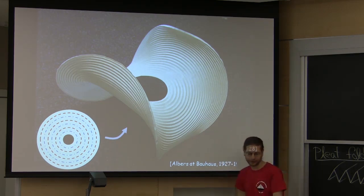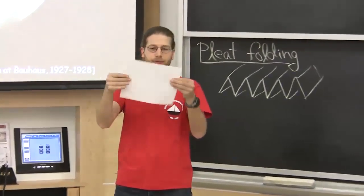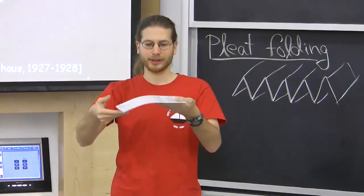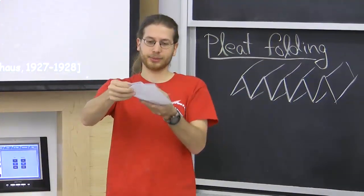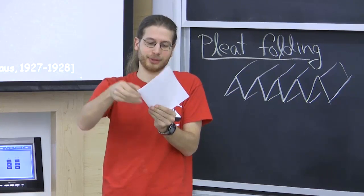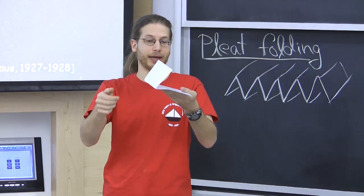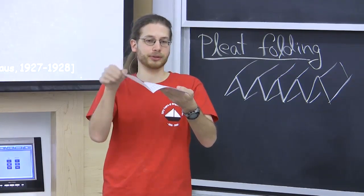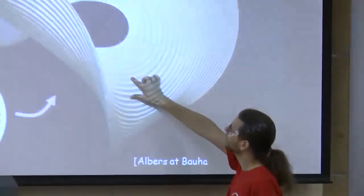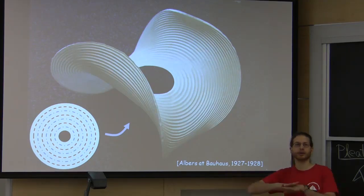What's going on with paper? Paper is an elastic material — it remembers that it was made flat and likes to be flat. If I curl a paper a little bit, it flattens back out; that's elastic memory. If, however, I crease a piece of paper, that's called a plastic deformation beyond the yield point of the material. This works in sheet metal also. I've effectively changed the memory of the paper; it now wants to stay bent. Depending on how hard I crease it, it will go to a sharper angle. So where we crease the paper it wants to stay bent, where we don't crease it wants to stay flat. It can't do all of those things, but physics finds an equilibrium among all those forces.